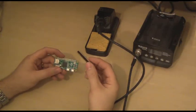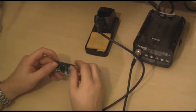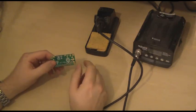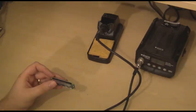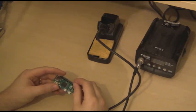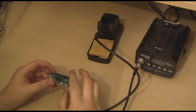Here are some header pins that I'm going to solder on. They just pop into the top of the Pi Zero and then they can be soldered to the back. It can be a little tricky to solder the headers on because you have to keep them straight when you solder them, otherwise any board that you put on top will be at an angle.